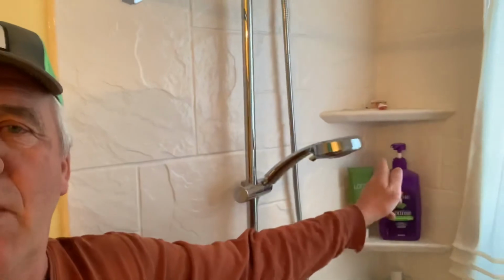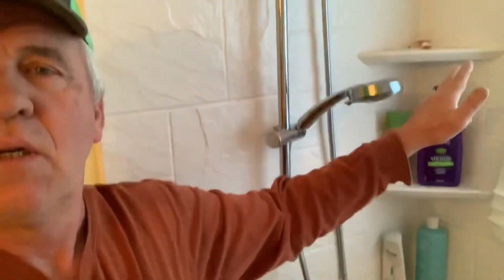I hope that helps you today. You know, when you're painting your sinks, your counters, anything bordering paint like this right here, it should be a paintable caulk. The silicones are more designed for inside the shower. When you're inside the shower, around these shelves, stuff that's not bordering paint, your silicones are used. All right, there you go.